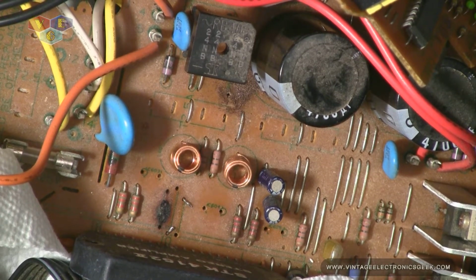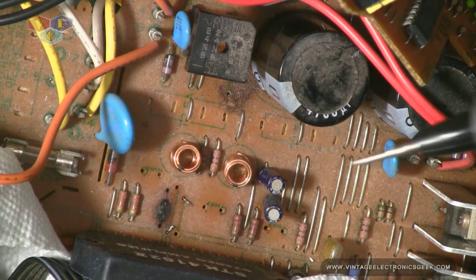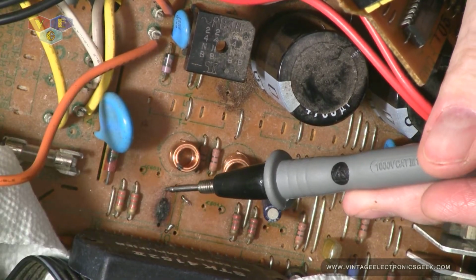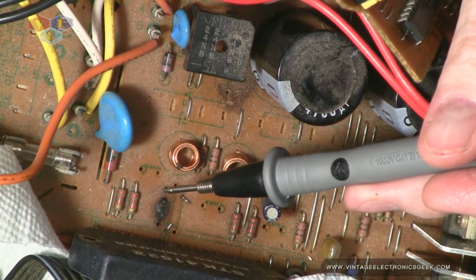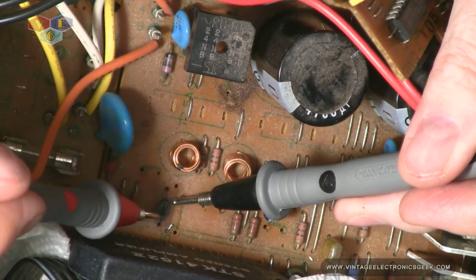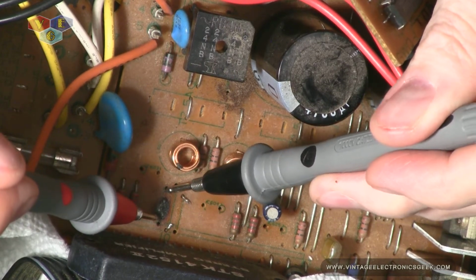So now I'm thinking, well, gosh, do I go forward and recap this whole thing or not? I gotta tell you, honestly, it was definitely a pain in the backside just to get these 4 pulled out of here. So we're going to try this burn area first, and we're going to check the carbons. Let me try to get my light a little better for you. Or not carbon, but, well, yeah, I guess carbon. Conductivity. And none.